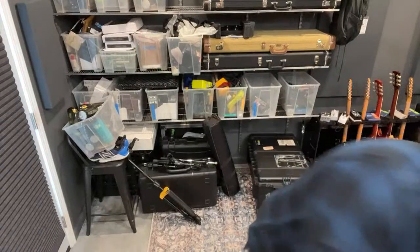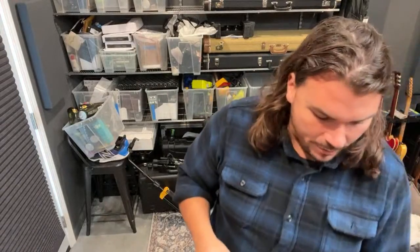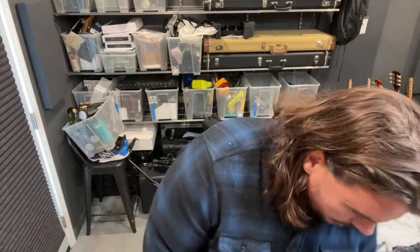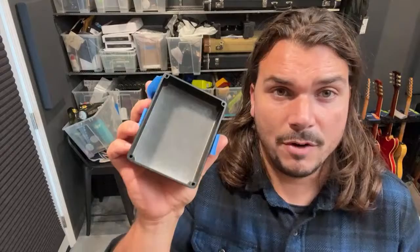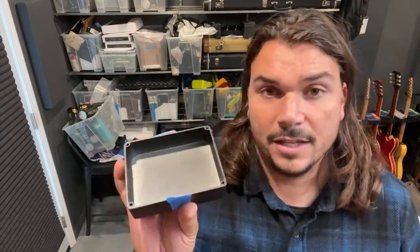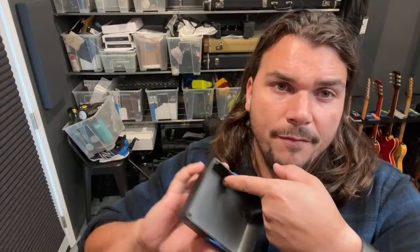And the way that you could ground it, if you wanted an easy way to ground it, I'll show you with like this enclosure, for example, which is a Hammond 1590BB. So you can see everything's painted right on the outside. And even actually on this one, I think because it must be not a Hammond and some sort of replica, usually Hammonds are clean inside. They're not like this where they're painted. You could Dremel off this paint so that you have a clean surface.